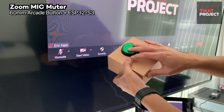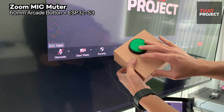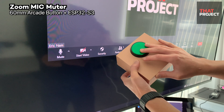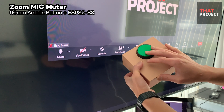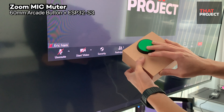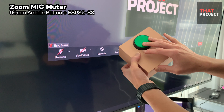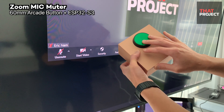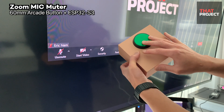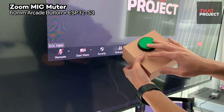The PC has the same effect as receiving user input from a normal keyboard. In the Windows version of Zoom, Alt-A is a shortcut for audio mute. If you are a Mac user, you can change it to Command-Shift-A. Not only Zoom, but all the hotkeys you want can be made into these hardware buttons. Hardware production is simple and it can be implemented very simply in the code. This source code can be downloaded through my GitHub page. If you have any questions about this project, please leave them in the comments below. Thanks for watching — see you on the next project.